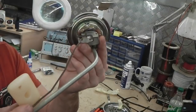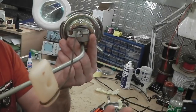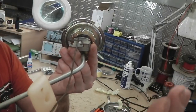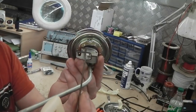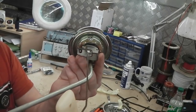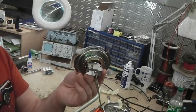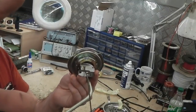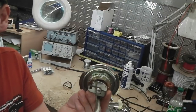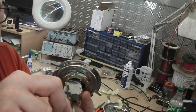So they might do it whereby they know that the last little bit of fuel in your tank, that part of the tank is sort of a small volume. In other words, it could have like a scooped out bowl shape in your tank, and this would be sat in it. You'd want it to respond differently when it gets to that area, because the gauge would still be thinking it's got all that. Cortina tank's 44 litres, so if you divided it out, if the tank was 40 centimetres tall, then every 10 centimetre drop would be 10 litres. But the last bit could be shaped differently.